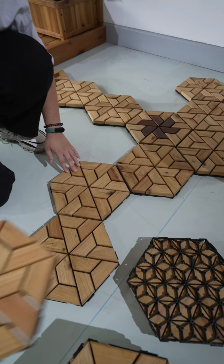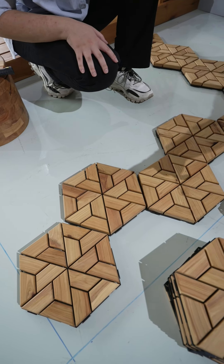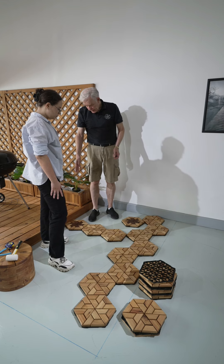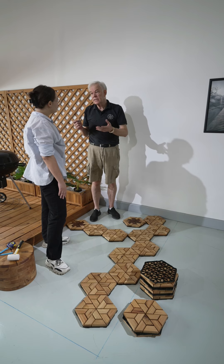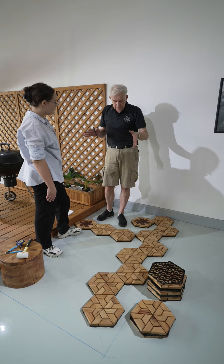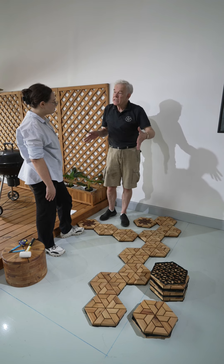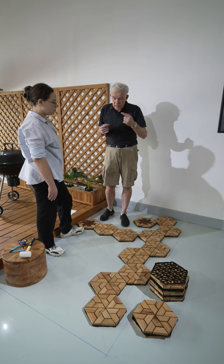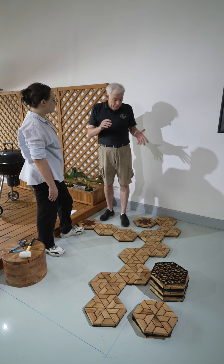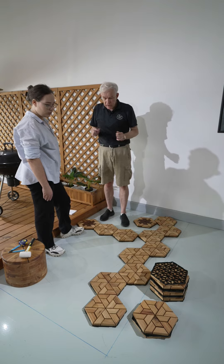In fact, that's not bad because we can now move these a little bit this way. I know that we have enough space now to put them all in. So we've laid out some tiles here and we know that from here is four and a half, which is fairly easy because we can cut in a number of ways. What we're going to do next is decide on our pattern and our layout. We've got our space, we've measured it, we know how many square metres we have, we know how many tiles we need. Our next problem is going to be: what is the pattern, what are we going to do with the edges, where are the edges going to be, and how are we going to cut them? That's what we're going to look at next.